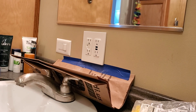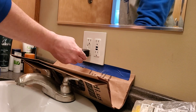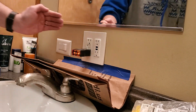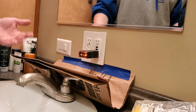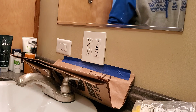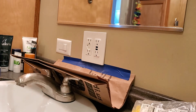Now this guy just snaps on here. I've got a tester — there it is. I'm going to turn the power back on and we're going to see if we did this right. Good news: the breaker didn't kick back off. We've got two orange lights — that's what we're looking for when we test the projects. And our new one — yes! That's what we want. Now I can have multiple things plugged in here, including that candle thing for when there's some unpleasant business going on in the bathroom.